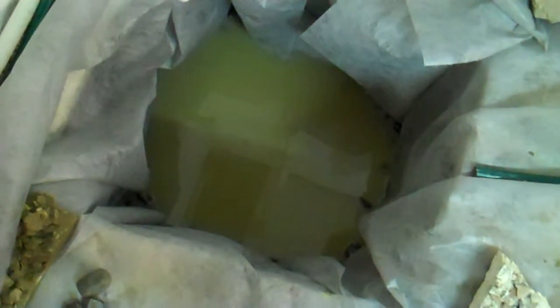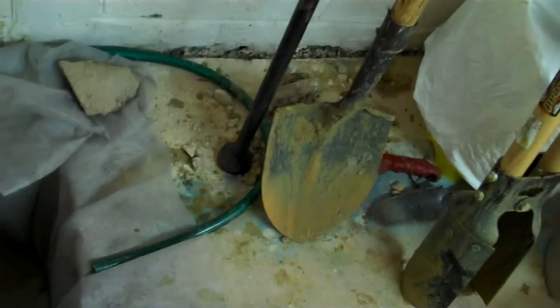So now the next step is essentially just to lower the sump pump basin into the sump pump hole, get it somewhat square, and then what I did too is once I put the rock in the sump pump hole here, I used my little pry bar thing with a little weighted flat part on the bottom. I punched it down pretty good so that it doesn't sink over time.